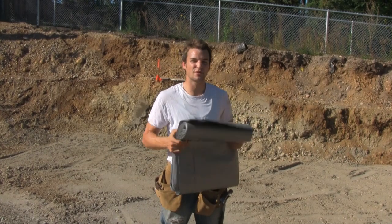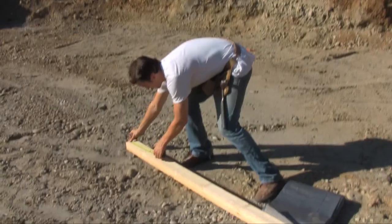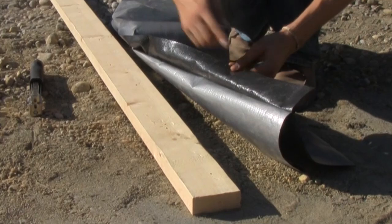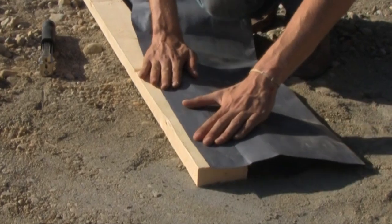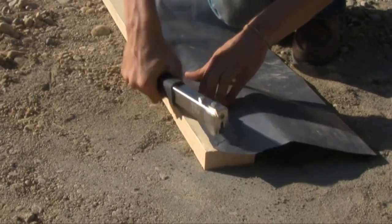Today we're forming a 7-foot high column. So what we first need to do is measure off on our first 2x4, 6 feet 10 and a half inches, allowing an inch and a half for our nailing plate. Then staple or nail the edge of the alignment tab against the corner of the 2x4, but place the end of our Fast Tube one inch past the 2x4, so we later have a half inch gap to position our Fast Tube.